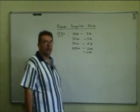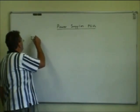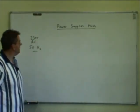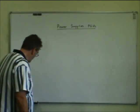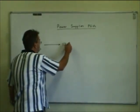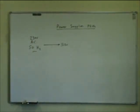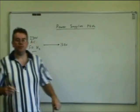So that's what we're trying to achieve. The problem is the AC mains supply is 230 volts AC, 50 cycles per second — 50 hertz — which is not suitable for running transceivers; that will cause grievous bodily harm to all transceivers. So we have to get a way of getting that down to a usable level of around 13.8 volts to run your amateur equipment. We need a supply to reduce that 230 volts AC down to 13.8 volts direct current.